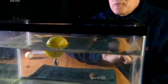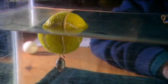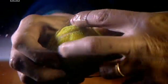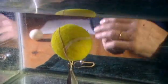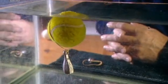Our analysis shows that when we place 1,000 pounds on the turtle hull as described by Bushnell, we're going to see a substantial amount of the hull floating out of the water. What we see, 1,000 pounds is not near enough. In fact, we would need somewhere in the neighborhood of 3,500 to 4,000 pounds of ballast to result in a hull that is slightly bobbing on the surface, as we can see here. Now, in this case, this is the way we would like the turtle to be on the surface, moving towards the HMS Eagle. This is a major problem that I see with the current design that's documented in history.